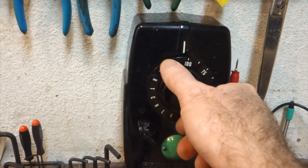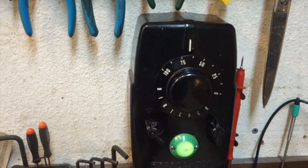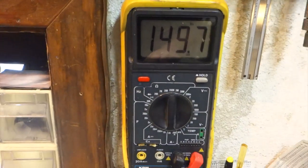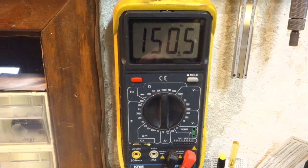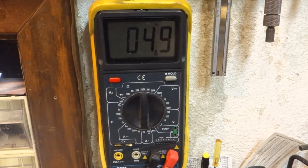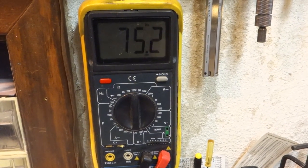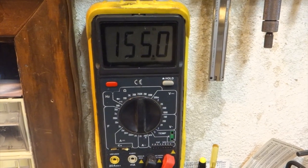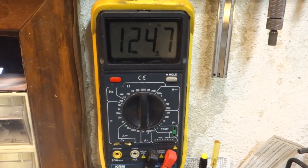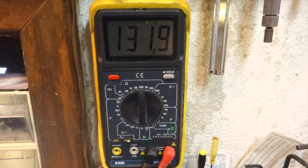We have the vise microphone and transducer to the tuner, quarter-inch to the tuner, turn on the amplifiers, and when we have a problem we can immediately switch over to the meter and start diagnosing without even taking the instrument apart. By seeing the readings here, when we turn this pan control all the way up we're ending up with an intermittent open circuit — which helps us streamline the search. We know we're not looking for a short. This narrows it down to possibly two solder joints that could be suspect or a bad potentiometer. It greatly streamlines the troubleshooting.